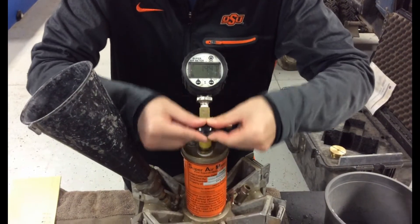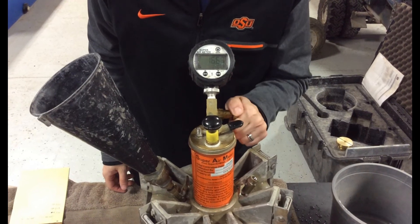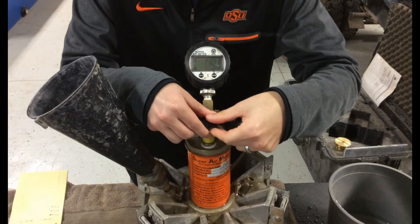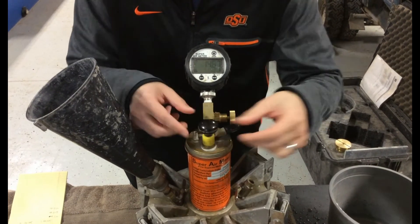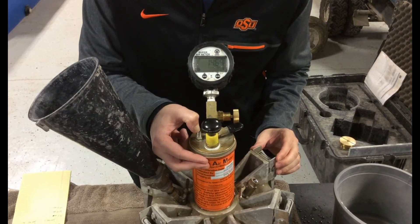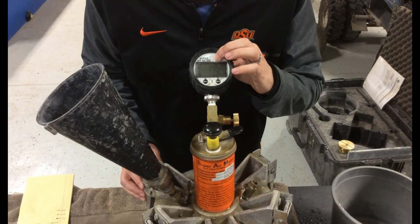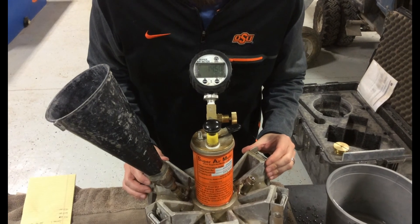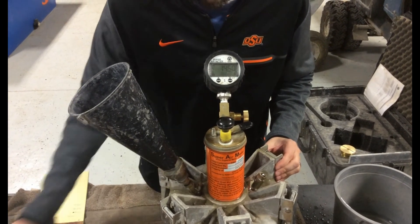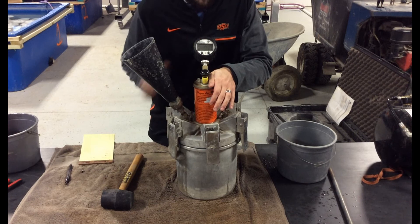After the filling step, press enter on the gauge to begin the SAM test and make sure both petcocks are closed. Pressurize the top chamber until you are close to the first pressure step. Use the needle valve to remove large amounts of pressure. You can also use the Schrader valve to remove small amounts of pressure. Once you get to the first pressure step, press the enter button. The gauge will read the current pressure and determine if it is stable, too high, or too low. After the gauge reads okay, hold the lever down and strike the side of the bowl once, then press enter again to start the 10-second countdown.